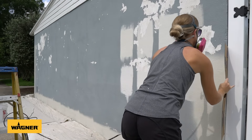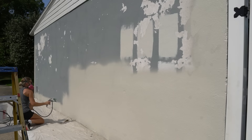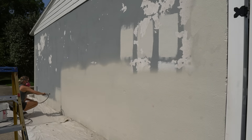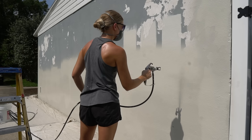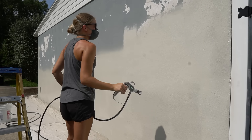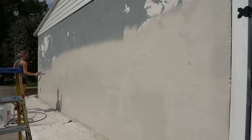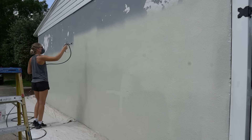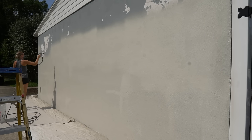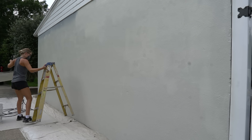You can find the link to this Wagner paint sprayer in the description below. Now let's take this time to get any other painting supplies out and easily accessible. Be sure you have your protective equipment ready: gloves, safety glasses, ear protection, respirator mask. In addition to the paint sprayer, I used a 4-foot ladder, some cardboard shields to spray close to the ground, and a metal shield with a handle for the sides and tops of the walls. Have some rags handy in case of any spills or to wipe up any accidental overspray. Finally, make sure you're in the clear of rain on the forecast — I've had to delay this painting project many times due to the rains down here in Florida, so be sure to give yourself a big enough window of time.